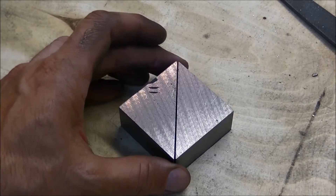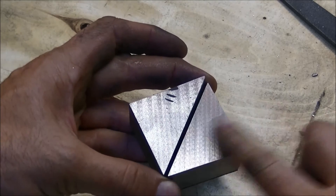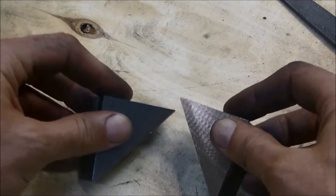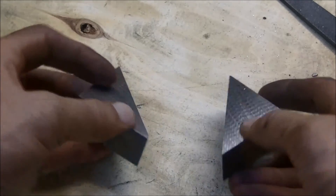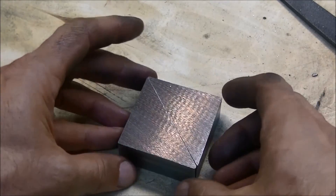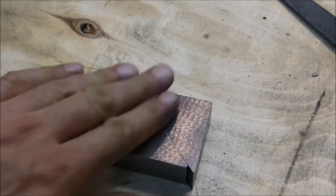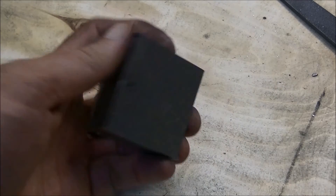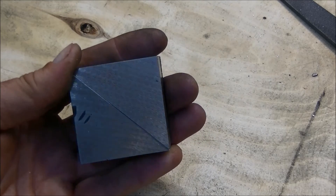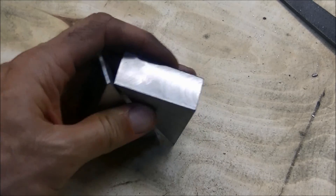Okay, so there's the first side with a couple dings in her — it's just for some fabrication, not milling or machining or anything. Just cleaned them up; like I said, they were drops. Turned out pretty nice. This side turned out okay. Finish is a little choppy — I didn't dress the stone — just to get the mill scale off and get a nice finish, probably within a good thousandth anyways. And that's the project all done.